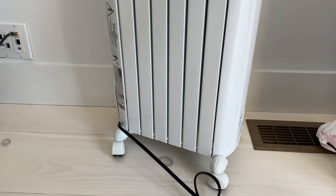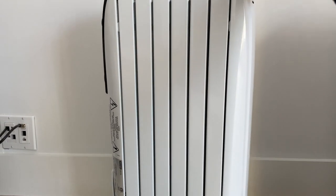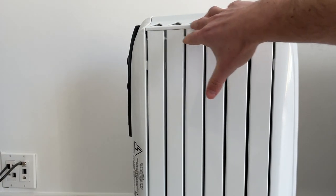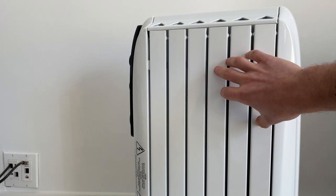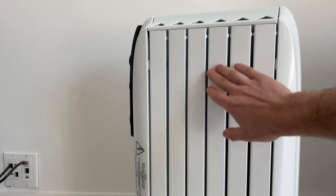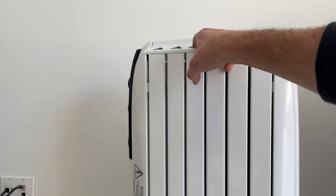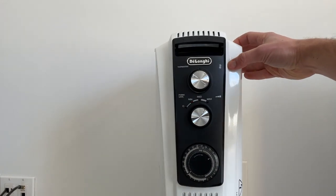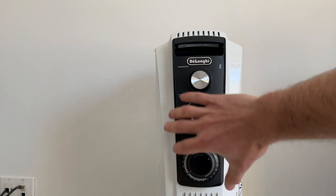This is a 110-volt model designed for the U.S. and Canada, with a full metal body and a lot of venting. It has top vents because the heat rises up through this — what they call a heat pipe design. The heat goes out through the top and circulates through your room. Since there's no fan, getting the heat where you want can be a problem, so typically you would either put a whole-room circulator in there or use the natural air currents in the room.